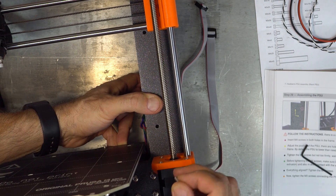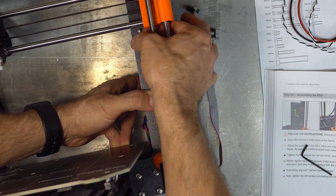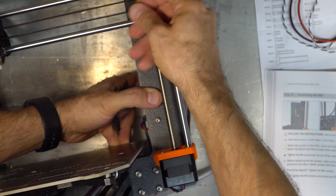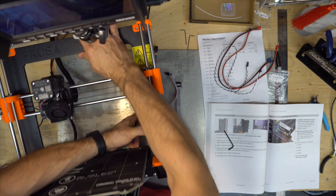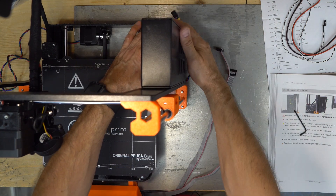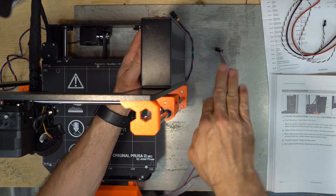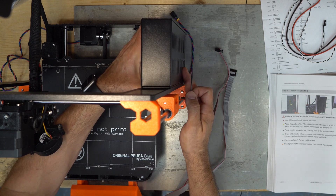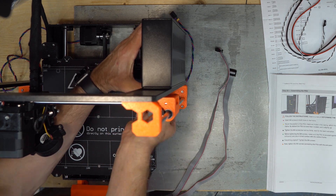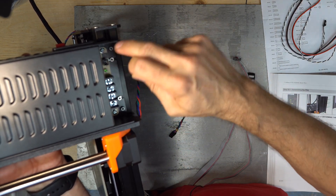Follow the instruction — there is a risk of deforming the frame. So find the two holes and insert the two M4 bolts and thread them in — not completely tight, but just thread them in until they touch the frame. Back up a little, same thing on the other side. Press down here so that the power supply is against the face of the frame. Look if everything is correct — you don't want to deform the frame, you don't want to push it inward or outward. Push in the power supply, screw in those two M4, and then the two M3x10 underneath. Everything is aligned.